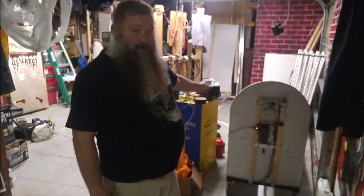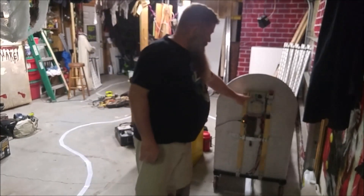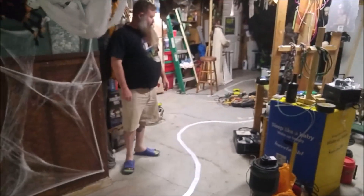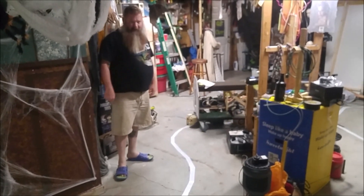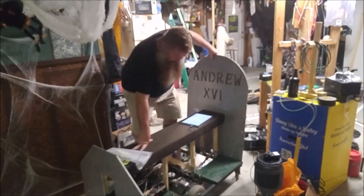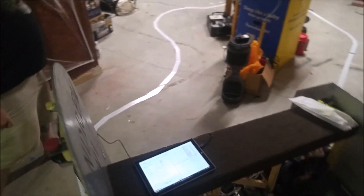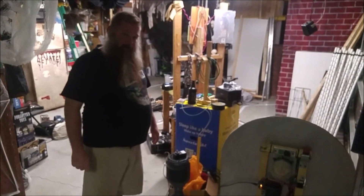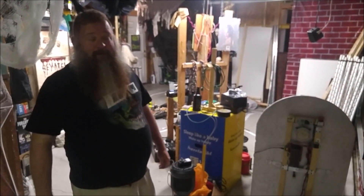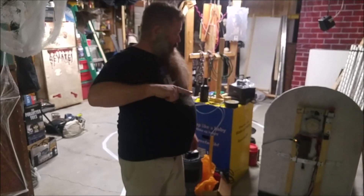I've enabled feedback and I'm going to start the cart. We have a temporary stop line on the ground for testing — that's why it stopped a moment ago. I've slowed the cart down a little bit closer to what we will actually run it in the maze. I'm going to hop on and it maintains speed, and now I'm going to hop off and it hasn't sped up. Next I'll show you some of the feedback on the graph showing what the motor is doing, and I'll also show you the gas lifter how that works as this runs around the circle.